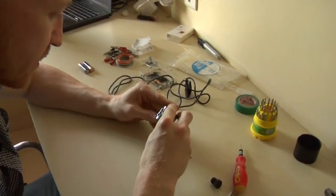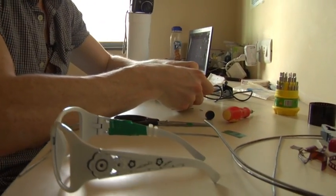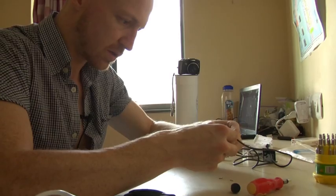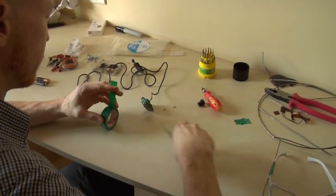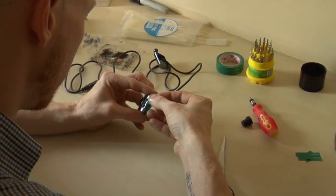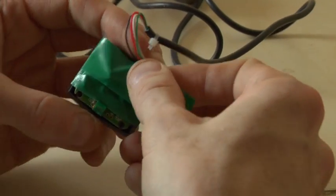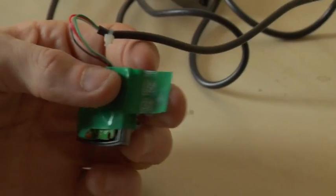The body of the camera is a bit inconvenient for our purposes — it's just a little bit of security for these parts, but I don't think I really need it. The circuit board of the camera, if I don't put the back shell on, has a number of electronics which could touch this copper wire and cause short circuits of the sensor. So I just want to make sure that we've got it completely electrically isolated.